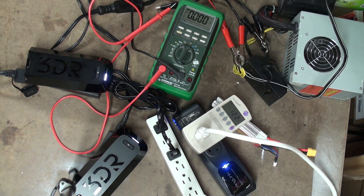So the inverter can handle it. The inverter was not the issue — it was the 10-amp limit on the DMM. But in theory, we're pulling right now 11 to 12 amps DC, and that's quite a bit for inside the vehicle.